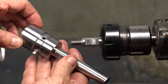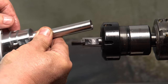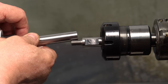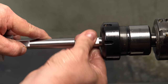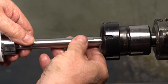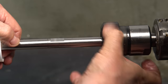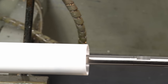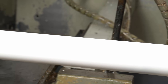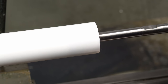Quick clean up and deburr and we're ready to cut some PTFE from the inside of the tube. Except, I made a really silly rookie error. Set the cutter to about half the finished depth and did a trial plunge for 3 inches or so. It worked brilliantly. I decided to go for broke and cut to the full depth for the rest of the length, so I removed the cutter head and reset the stick out to get to the right finished internal diameter. Then I popped it back into the tube and tried to cut the larger hole.